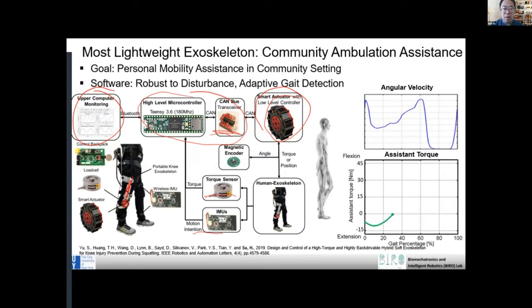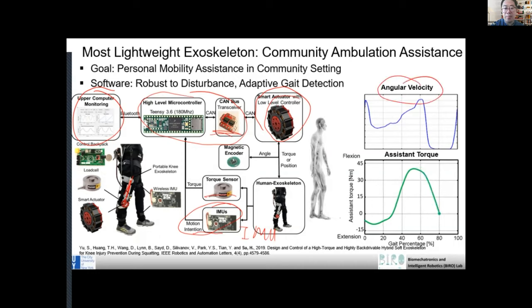And from those sensors, for example, from the motion sensor, it's called an IMU sensor, inertial measurement unit sensor. We can detect the angular velocity of the person during walking, and we can measure the angular velocity to understand human walking, which we call a gait cycle or gait percentage. Because walking is a repetitive process, and it starts from, for example,